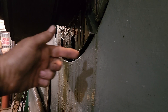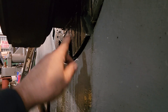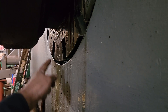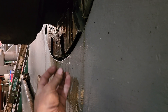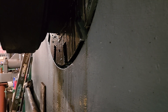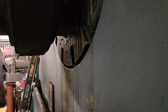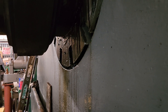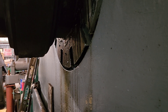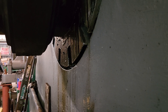There is a groove in the babbitt that runs lengthwise, and the lube line will tie into that groove so that before you even start moving the engine, you pressurize this line, which pushes oil underneath the journal and hopefully envelops the entire bottom of the journal surface. So when you get it started, you don't have to wait for the engine to make one or two revolutions before it sucks the oil — the oil's already there. This will cut way down on starting force needed and on wear on the main bearings and journals.